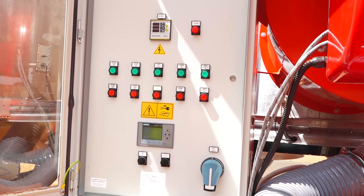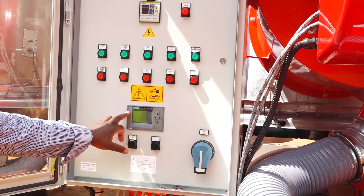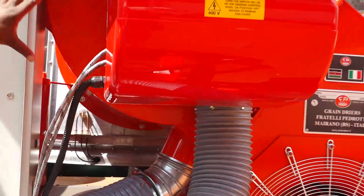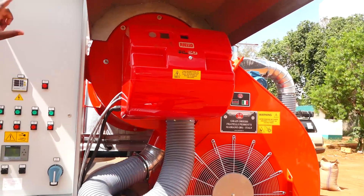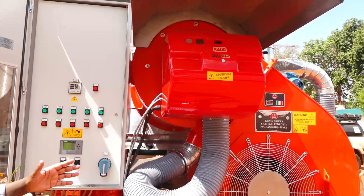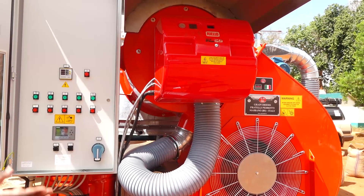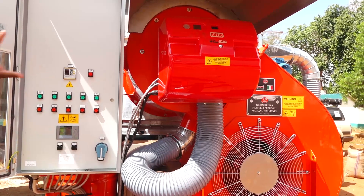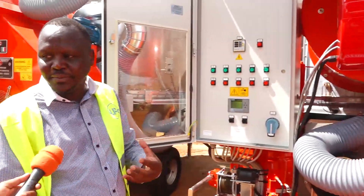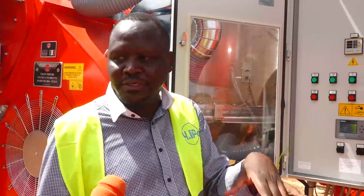This is the control panel. We switch the machine on here and use these controls. Basically, here we set the burner temperature — the burner is this device here which uses diesel to release a flame into the baskets. We'll also set the grain temperature; there's a sensor inside that balances those. When the grain temperature reaches the set point, which we set at about 50 to 60 degrees, the burner shuts off and then it cools down. The third setting is the cooling down time of the grain — once it's heated to that temperature, it cools down so it can be extracted at normal temperature, having exhausted moisture to the required level, typically about 13 to 14 percent moisture content.